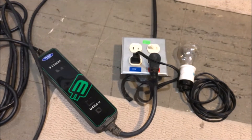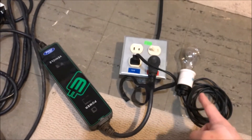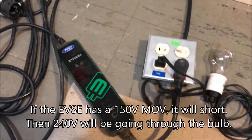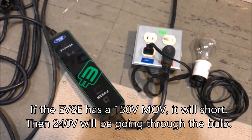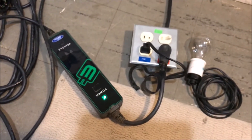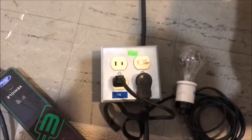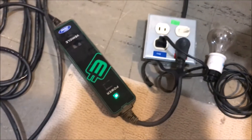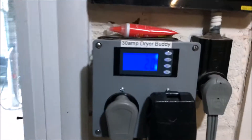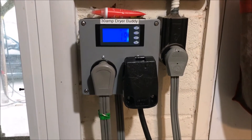All right, that's plugged in. Now this is all hooked up, so when I turn on the switch, either the lightbulb will light up extremely brightly — because it's only a 120 volt bulb — and I'll need to turn it back off right away, or the bulb won't light up and the EVSE will come on. Let's find out. You can see the bulb is not illuminated at all, the EVSE is on, and we are drawing 2 watts, which is pretty appropriate standby power for one of these.